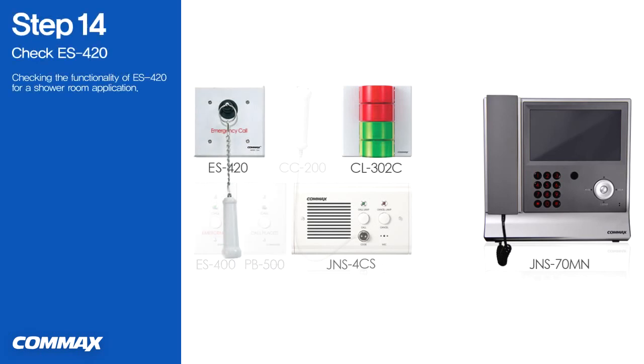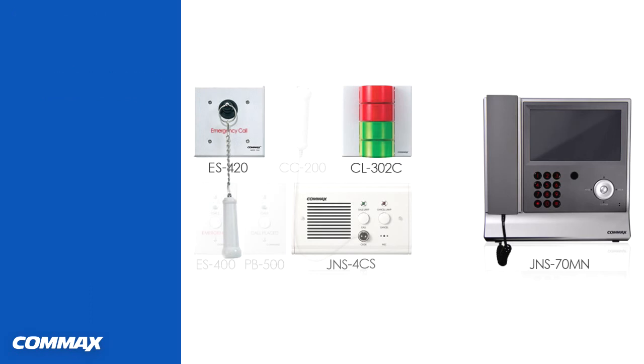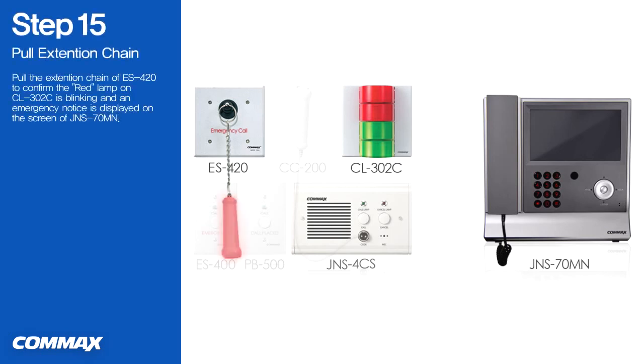Now let us check ES420, an emergency paging switch for a shower room application, for its functionality. As you pull the extension chain of ES420, confirm the red lamp on CL302C starts blinking, and an emergency notice is displayed on the screen of JNS70MN.